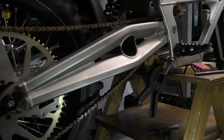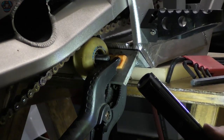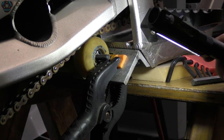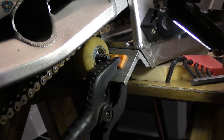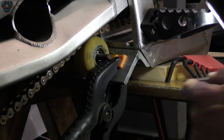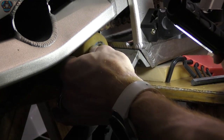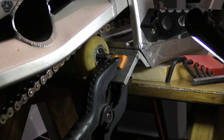Alright, so I got things where I think I want them. Looks like my bracket fits pretty good. Could have made it slightly different, but I think I'm okay. What I'm going to do is probably make some small aluminum standoffs and then tack weld them to this piece of aluminum here. I need about three quarters of an inch or so in the air. Maybe I'll come back and trim this corner off this bracket. If I have the wheel up like that it still sticks down past the bottom just a little. Thumbs up. Now we need to fabricate a few more parts, but that's tomorrow — I'm going to bed right now.